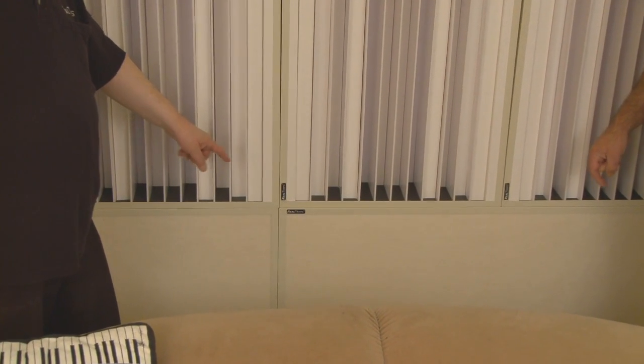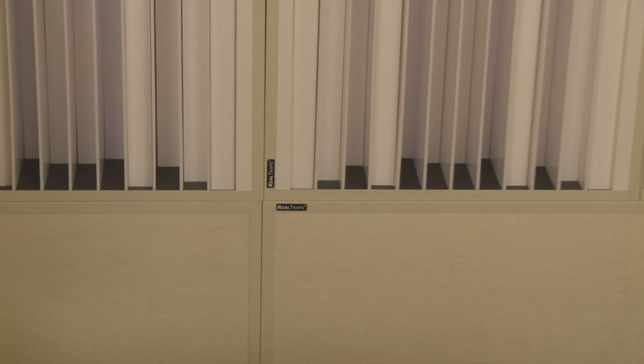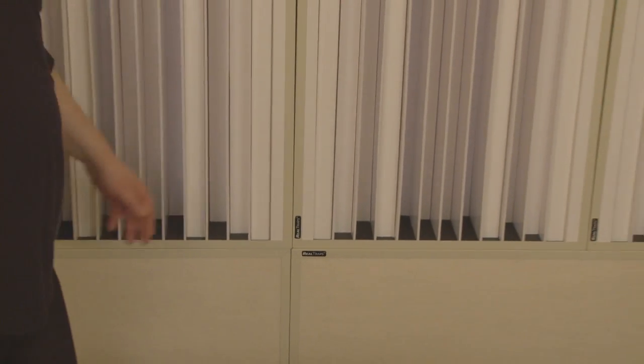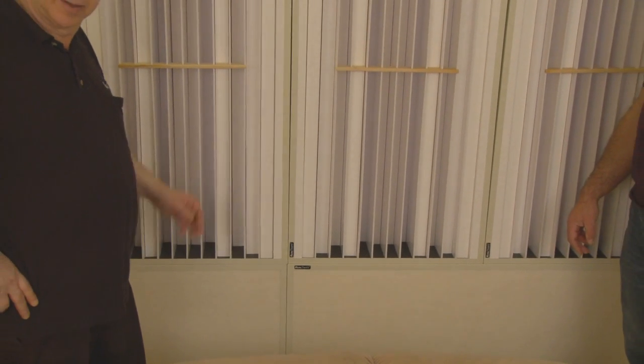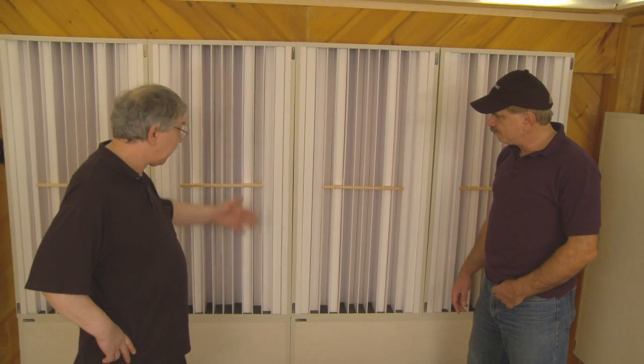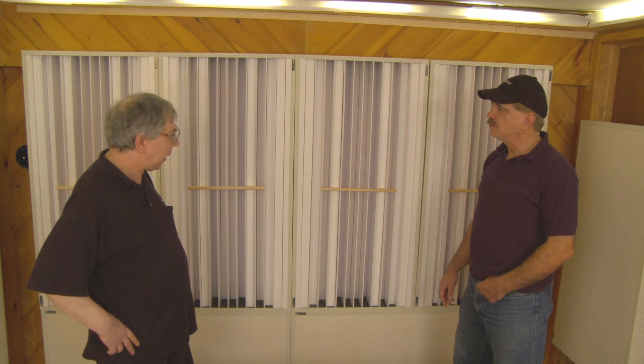These are the two-by-four-foot Mondos, and this is great because nothing has to be hung on the wall — it's absolutely totally stable. The Mondo traps are just sideways on the floor. That's a perfect place for bass traps because it's a floor corner, and because they're so thick they don't have to be angled and straddling the corner — just being right at the corner on the floor is a perfect place for bass trapping, and that becomes the foundation for the diffusion.